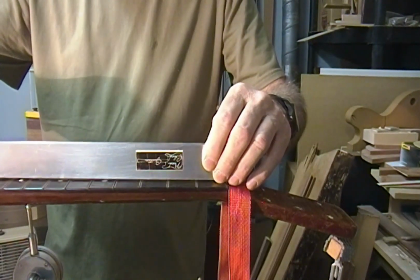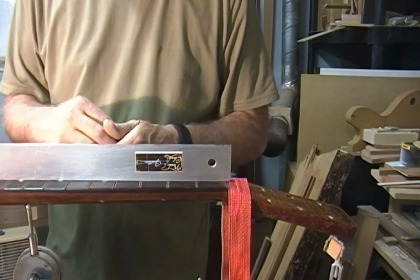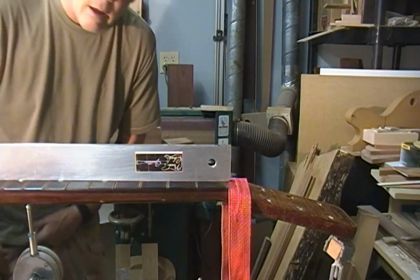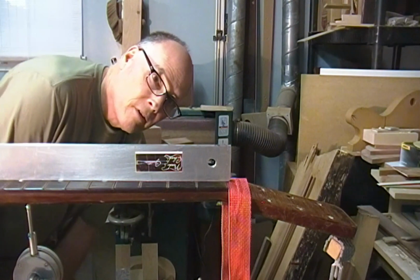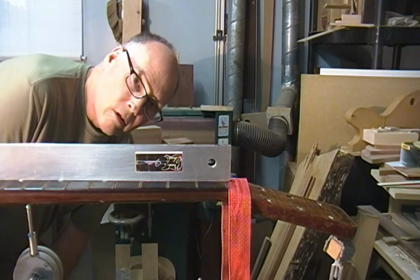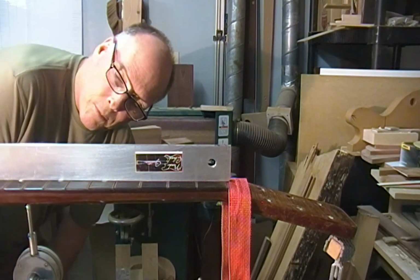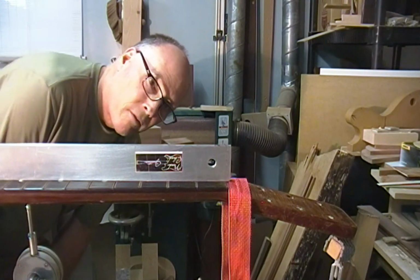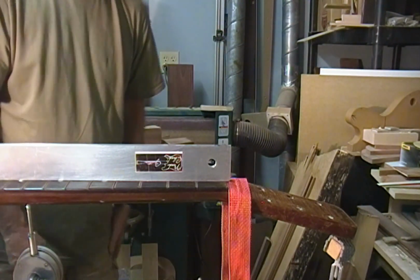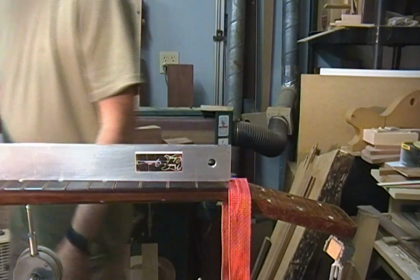Now when I had frets in this thing, I checked it off the top of the frets, and I had an underbow, a relief of about 7 thousandths. And if you recall, I hope I'm getting this correct, I had about 12 thousandths of back bow with string tension on it. When I took the strings off of it, before I pulled the frets, I had 7 thousandths of relief.